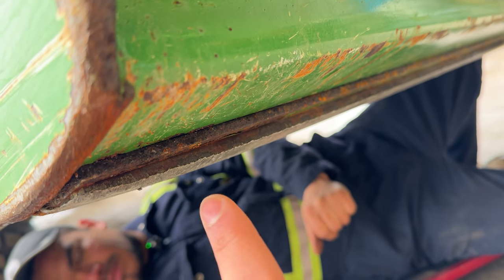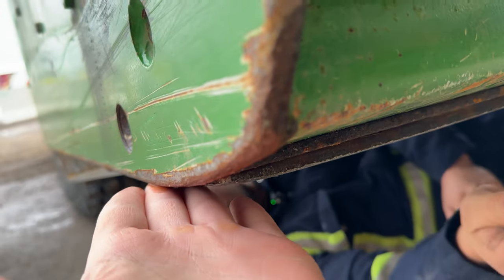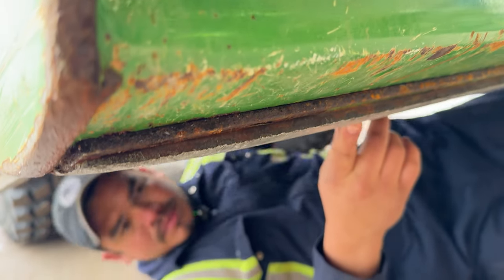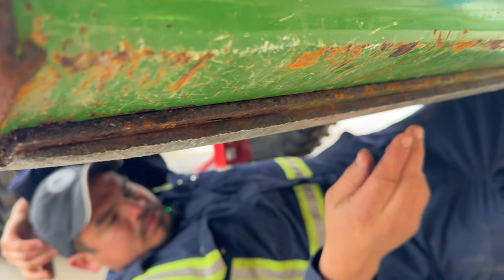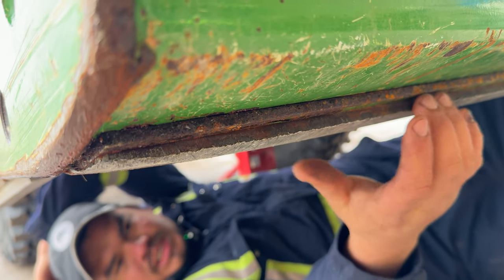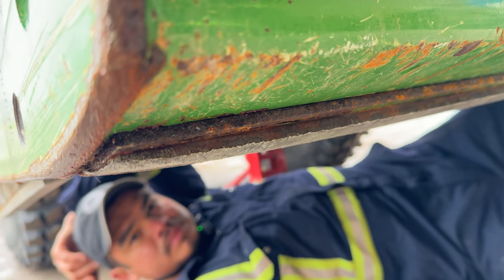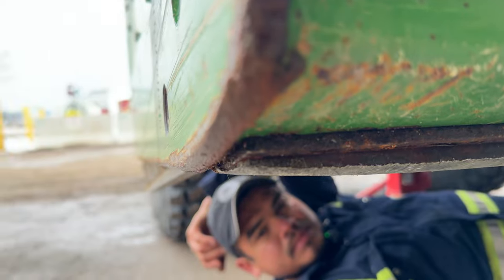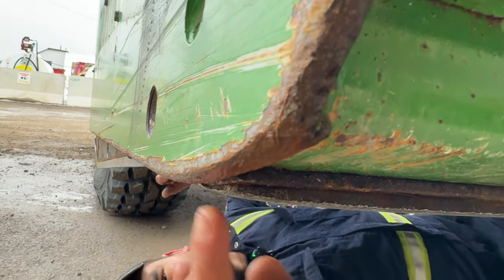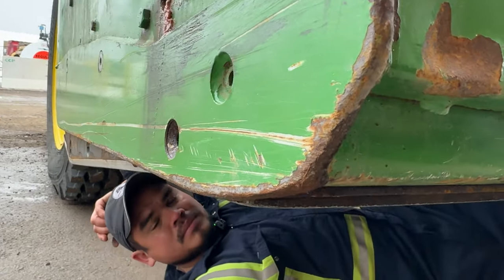When we originally put the stainless steel cutting edge onto the blower, we realized that the sides here were touching the ground, but the blade wasn't touching the ground for the cutting edge at all. So Eric is like, hey man, we got to beef this up a little bit. As you could tell, there's a flat bar of steel, about a quarter inch, 316 as well. Yeah. We put that steel bar on to beef it up a little bit, that way the cutting edge touches the ground. You can see from the side angle here, it's just enough material to add a little bit of height so that the sides of the blower weren't scraping the ground first, as you could tell on the box here. So that's why we had to beef it up.